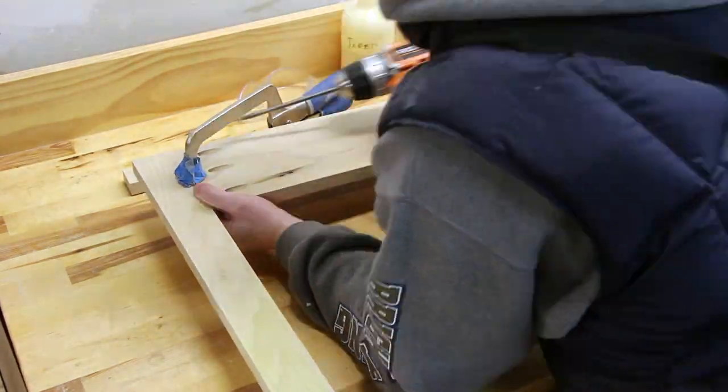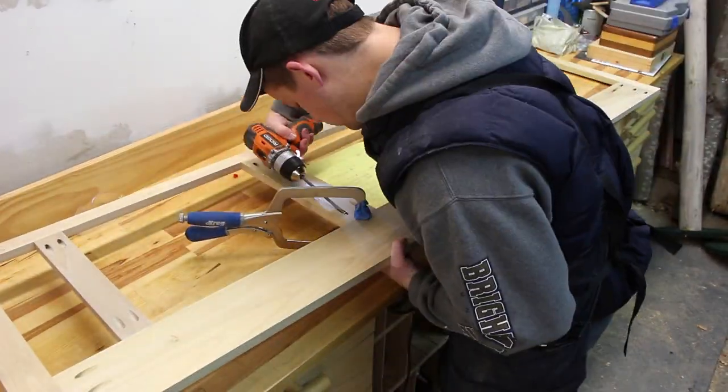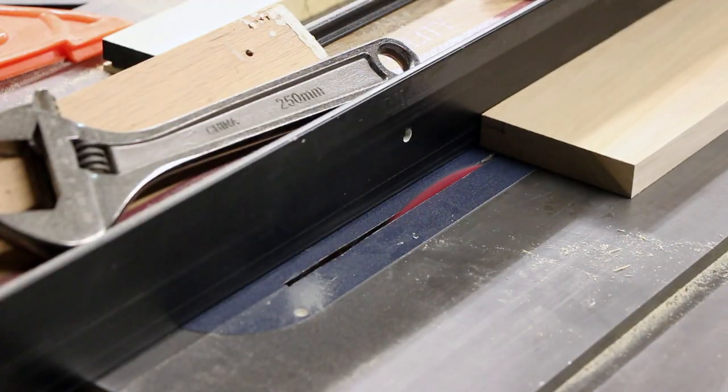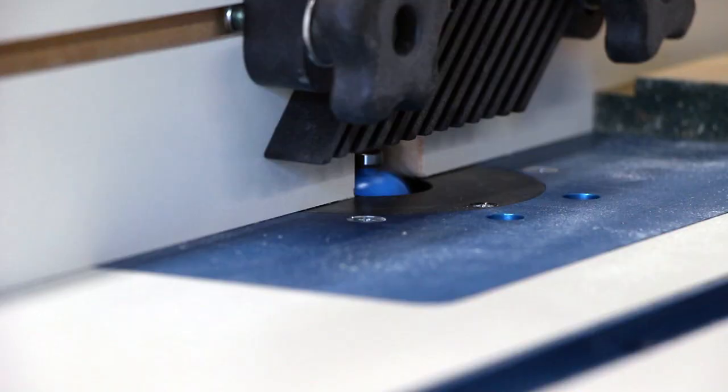This build is essentially a face frame cabinet without the cabinet structure. I built the frame with poplar, just like the vanity cabinet, using pocket screws. I also made the trim to match the vanity style as well, using a cove router bit.